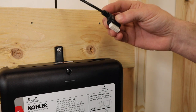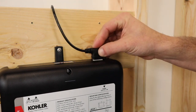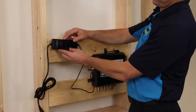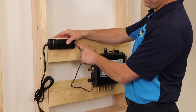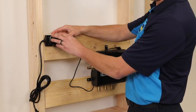For installation of the power cord, the cable will go towards the direction of the inlet. It is keyed so it can only be installed one way. Press firmly until it stops. Mount the power brick — there are four openings to secure it. Be sure that the power brick is mounted above the unit and avoid areas where water can cause damage.